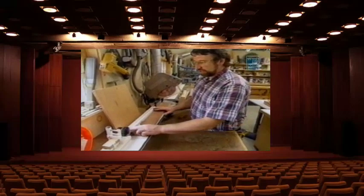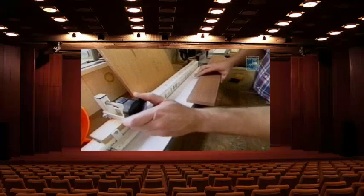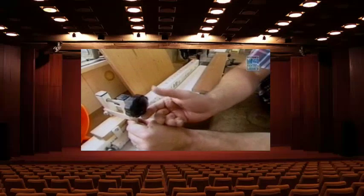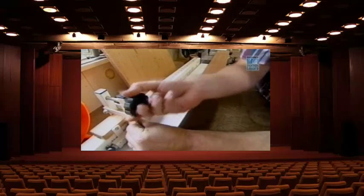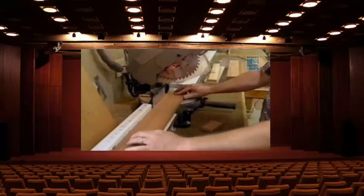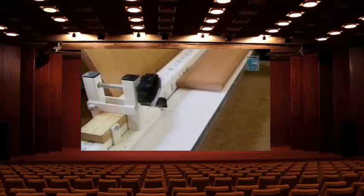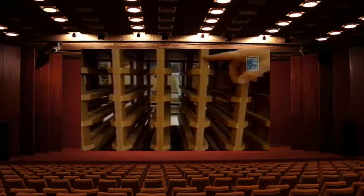This project is all about repetition — there are dozens of parts to cut the same length, and this is where a saw stop system for the miter box comes in really handy. It has a built-in tape and a stop which can be easily moved and set at whatever measurement I want. This first measurement is 29 inches, which means I can cut piece after piece exactly the same. All the 29-inch standards then get dado'd on both sides.